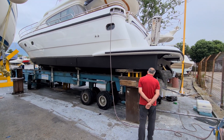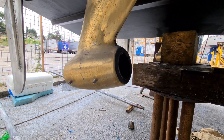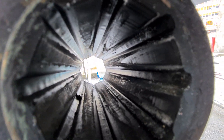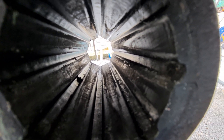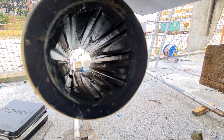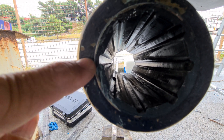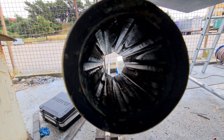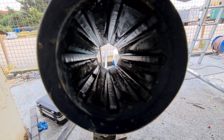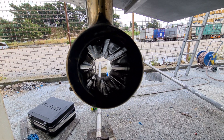And then finally we can go into the water again. Here I am down at the aft bearing - I'd like to show you how it looks inside. You can see we have some wear on the rubber. These are water-lubricated bearings, meaning water goes in through these channels and lubricates the shaft so it can turn easily. But as you can see, we have some wear on the bearing, which means we had about 1 to 1.5mm of play, which is not good. So we decided to change it.